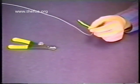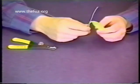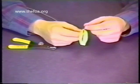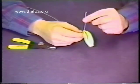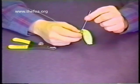It's very slippery under there with the Kevlar. Discard that into your fiber trash bin, and you'll expose your Kevlar and the white — or whatever color may be in your case — PVC buffered glass fiber.